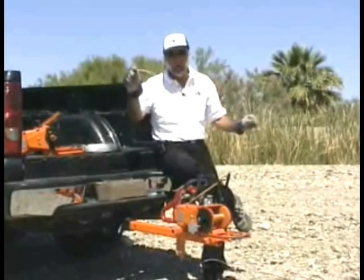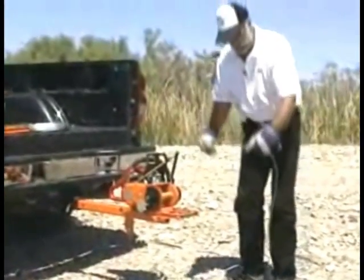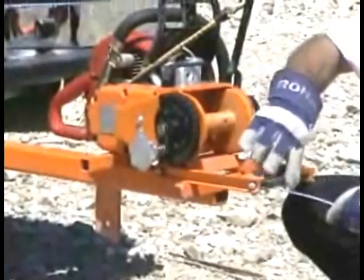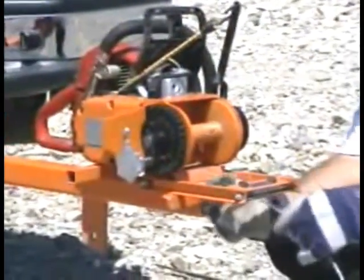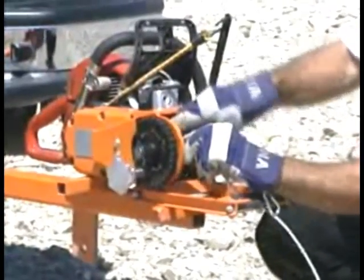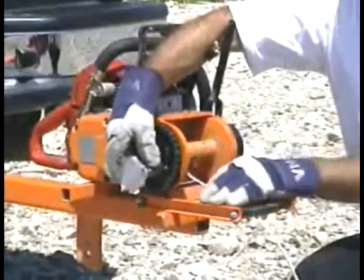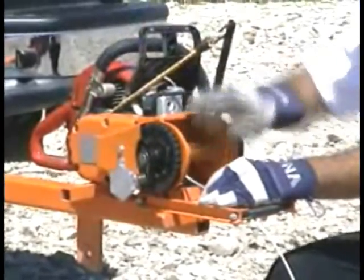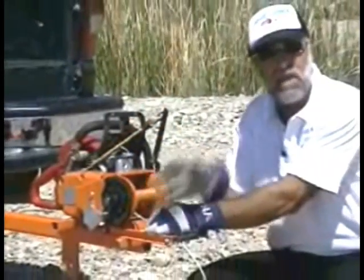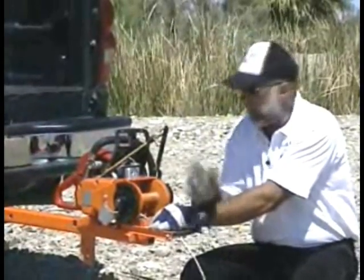Now I'll show you how to load up your cable. Once you've got all 150 feet stretched out — or if you're replacing your cable, take all the old cable off — run your new cable in underneath the roller on the front of the fair lead and then between the two side rollers. Then simply stick the cable into the hole provided. By hand, roll up several wraps, and when you get 10 to 12 wraps put a piece of duct tape around it so you know when pulling cable out that you've reached the end. Make sure you've got a weight on the end of your cable, fire up your saw, and bring it in like you would if you're pulling in your load.